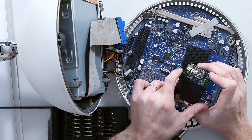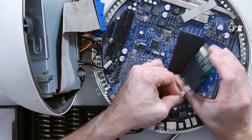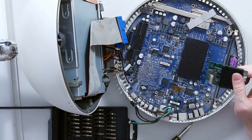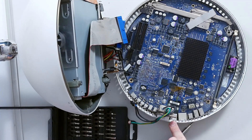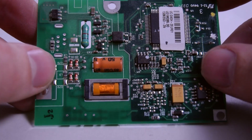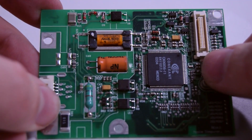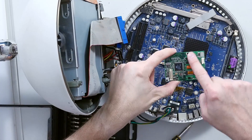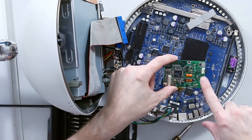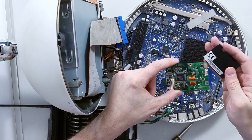This little daughter board has a nice riser pin and also a daughter board connector which runs to another small daughter board — the phone line connection. That's the RJ11 for the phone line, so this must be a dial-up modem, which makes sense because there's a big segregation between the two circuit sides. I can see that this side of the PCB is very unpopulated with no ground plane at all, so this will be all your phone line side — up to 50 volts in the UK, or higher actually.